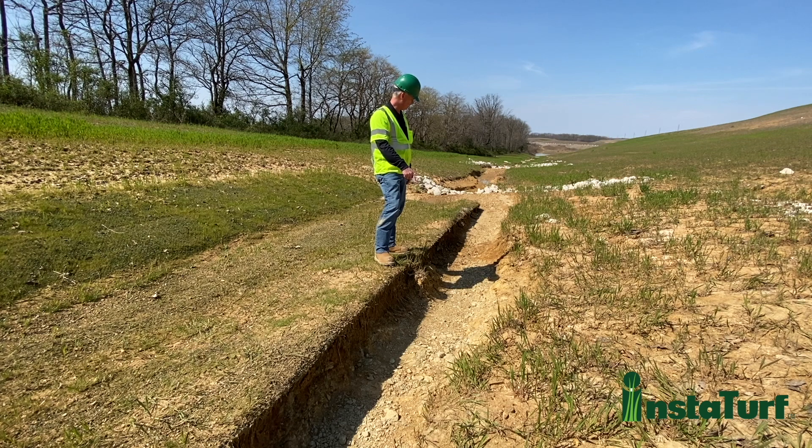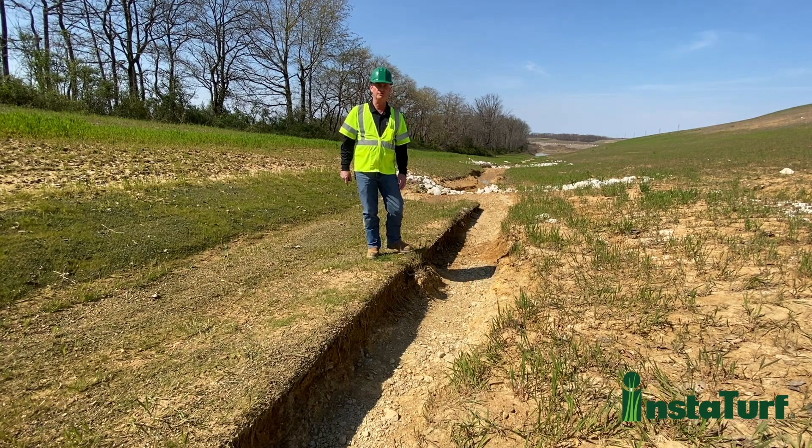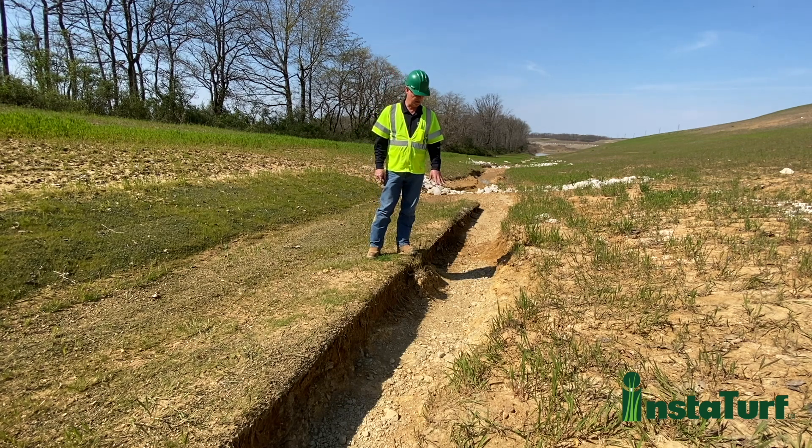This gully is about 12 to 24 inches deep and three to four feet wide at this point. A lot of this damage actually occurred about a month and a half after the product was installed, and it has gotten deeper and wider through the winter months. We had a tremendous amount of rain this past winter — probably close to 30 inches of rainfall through the end of March. This channel has taken a lot of flow, and it's certainly done a lot of damage to these highly erodible soils, however with the Shearforce 10 protection there is no noticeable damage whatsoever.